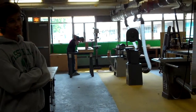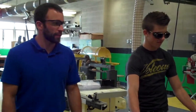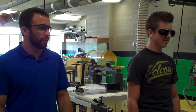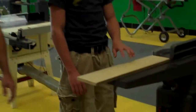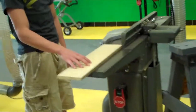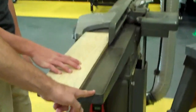The method. A wood board is laid on the workspace, and carefully led through the infeed of the circular machine saw to make sure of the straight edge. Use a guide. Okay. So basically, what it's stating there is we are going to lay the board down. If we're going to do a face joint, we'll lay it down on the surface. Okay. It will be fed through the machine off of the infeed table.